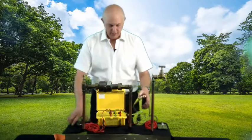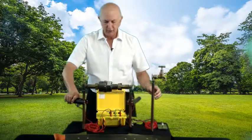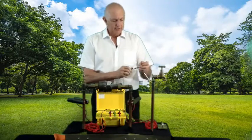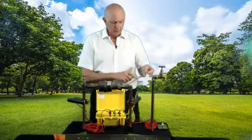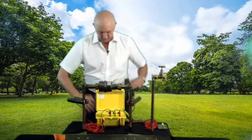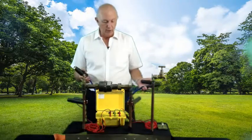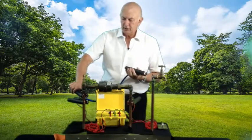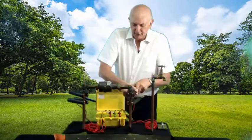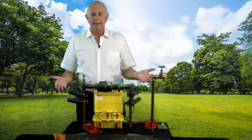To do a meter change, put the PlumGuard clamps onto the pipe for the meter, connect the earth cable to the earth stake we provide, and put it into the ground. The PlumGuard is now monitoring — it's not alarming, so it indicates a safe work area. Next, put the jumper leads on as your second level of protection, making sure they have a firm grip onto the pipe. That's it.